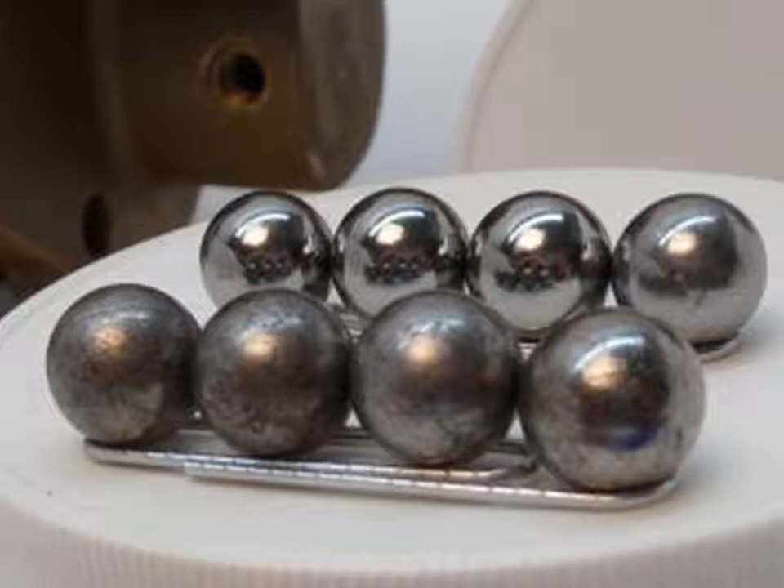As you look closer, you will see the pits upon the balls. Where does this come from? When the surface gets hot, it opens up like a micron metal sponge. And when it opens up and the pores open up upon the surface, little pieces of the metal start to break off. And then when they break off, they become a part of the grease, and then they start to bang into the bearing. That is where you see the dimples. They started out like the bearings on top. This is the result of them on the bottom.